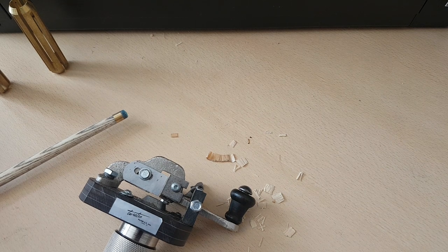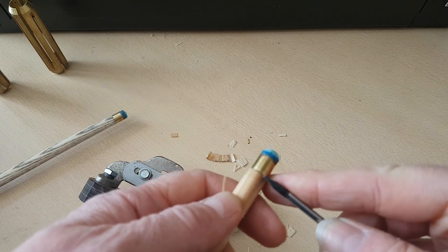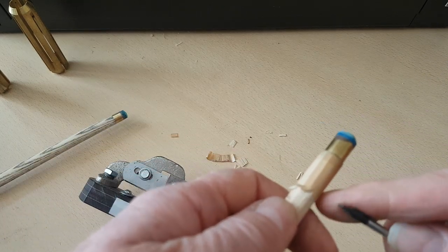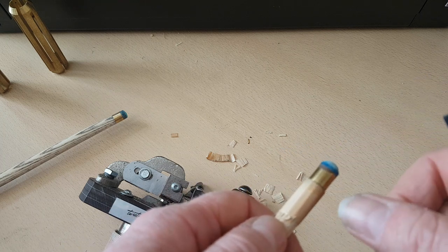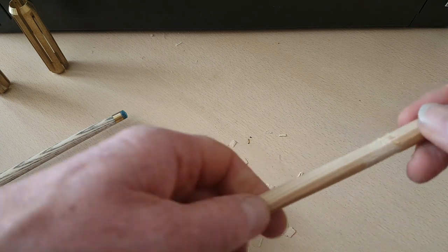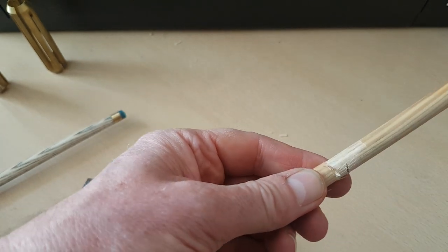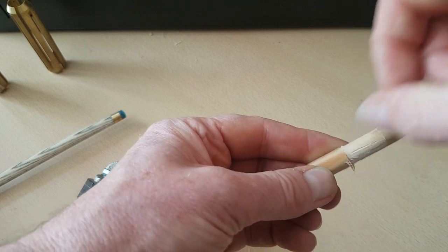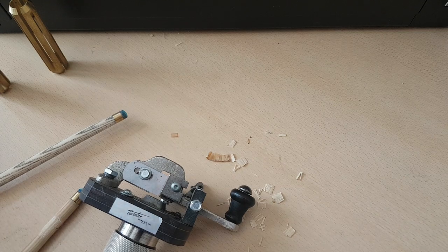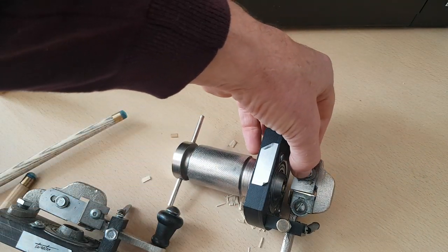Next fault: ripping the wood under the ferrule. If you try it on a tenon and it starts to rip the wood at the base, it's because the bottom blade isn't adjusted in far enough. That's the first piece that's got to cut — that's why I kept running my finger over the top, just so you could feel it protruding more than the other blade. That way you know it's cut into the tenon before the other blade gets to it. If not, it will splay all the wood at the base. Definitely don't go near a cue until you're happy with the adjustment.